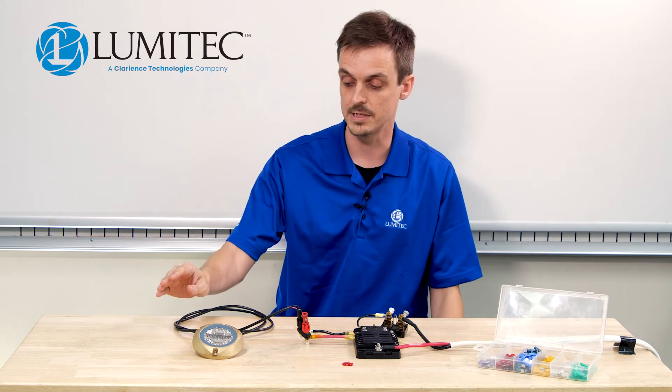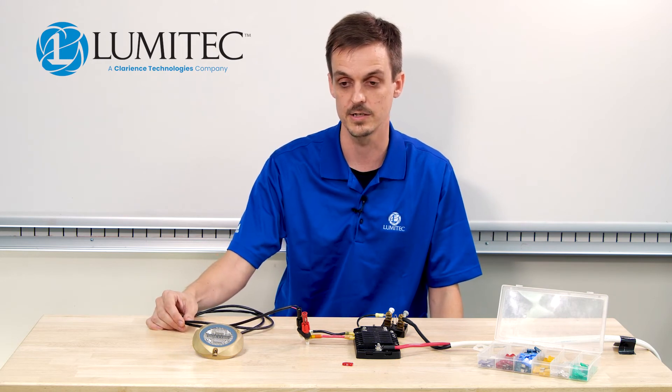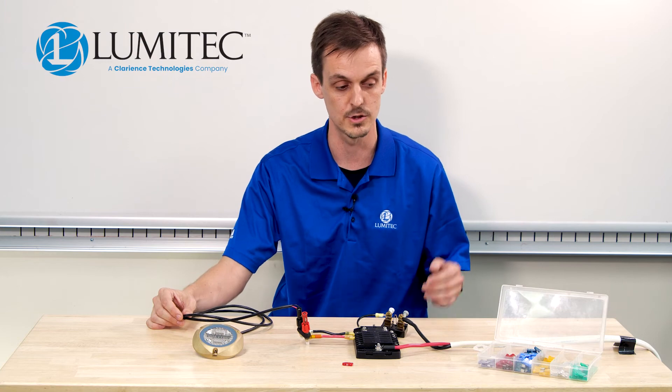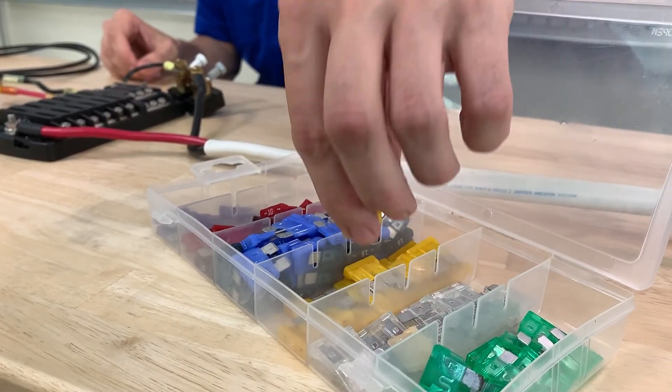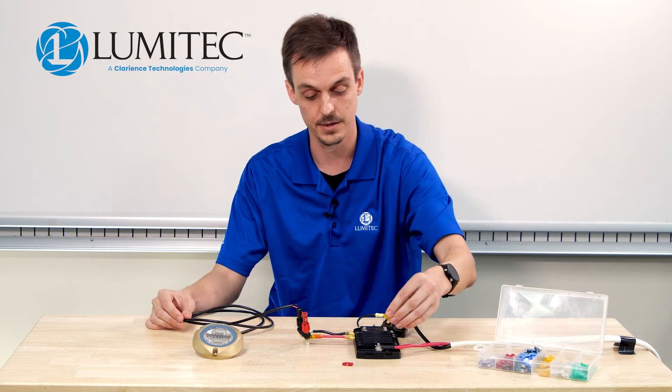For the maximum, I know I'm using an 18-gauge wire with a 105°C temperature rating, so from the table I can see that a 20-amp fuse is the maximum allowable. So anything between 10 and 20 amps would be fine and safe to use.